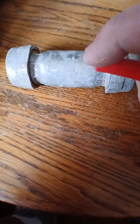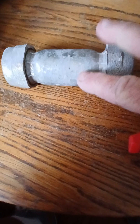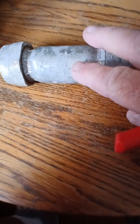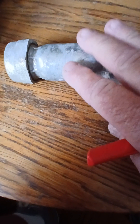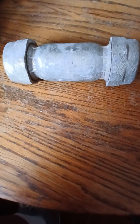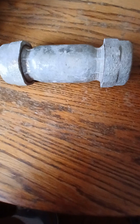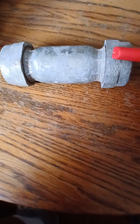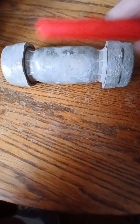When you use this, be sure that the end of your pipe is deburred, because if it doesn't, it's going to ruin this fitting. Not many of these are used anymore, but there are extenuating circumstances and situations where when money's tight and you want to join two pieces of copper, it's a good way to do it. You just have to get it good and tight on both sides, so you could use galvanized and galvanized.